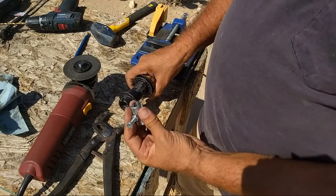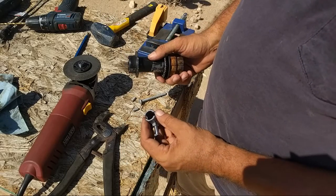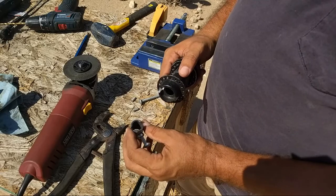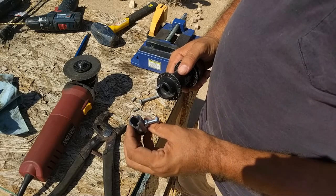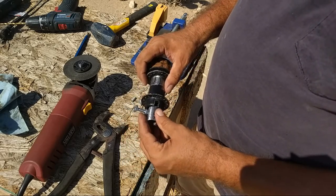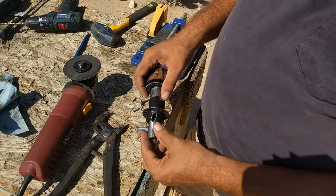And then these iron pipes are 1/2-inch iron pipes. I realized with a little bit of time, I could take a 5/8 drill bit and bore it out. It wasn't that much, so this is a little bit thinner, but it does fit. And it's steel, so it's fairly strong, right? So it's kind of like that's the way it's been going, is just, okay, one little problem at a time, just keep working through it until you get it all solved.